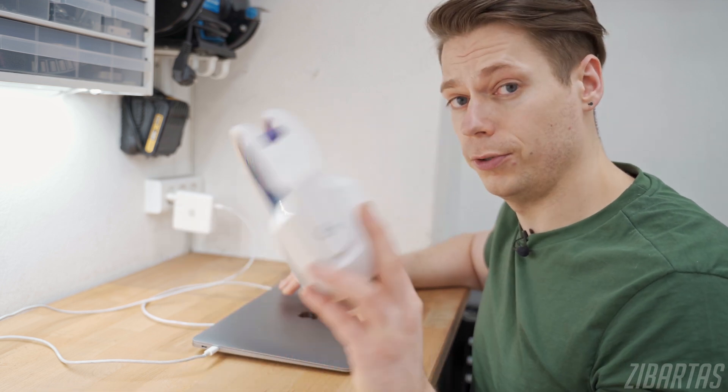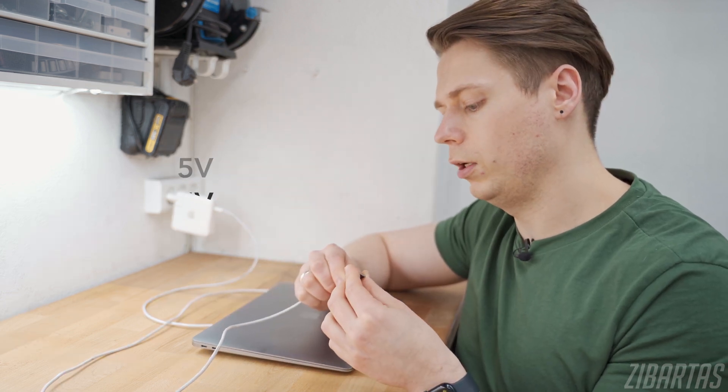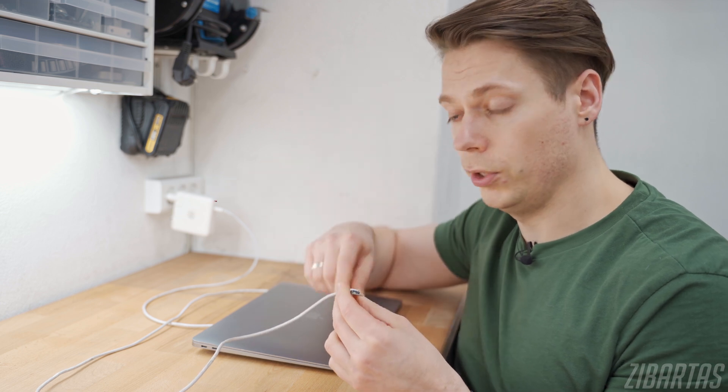This active negotiation between devices is what makes your laptop charger charge your laptop really fast, but also work for your headphones too. Unlike a regular charger, this communication is digital. So until now, homemade adapters were not really feasible — but that's where this comes into play. This is a PD trigger board. What it does is trigger a particular power state in your charger based on its preset voltage. This one is preset to 9 volts, so whenever I plug in a compatible adapter, it will negotiate a 9-volt link, and now I can connect a 9-volt device.